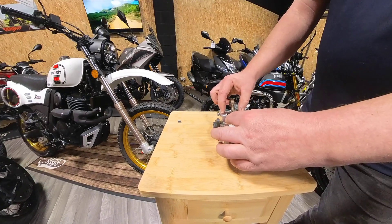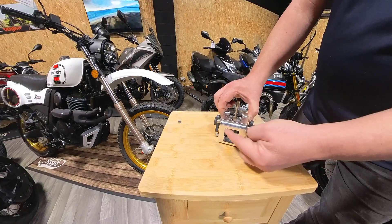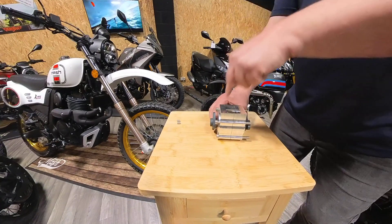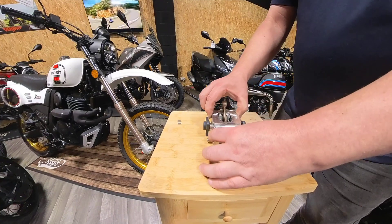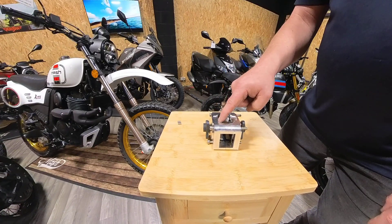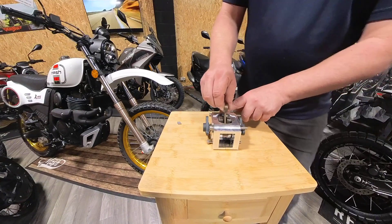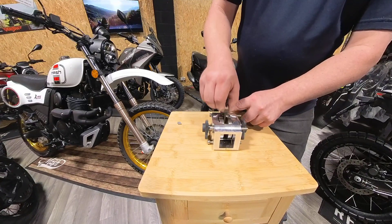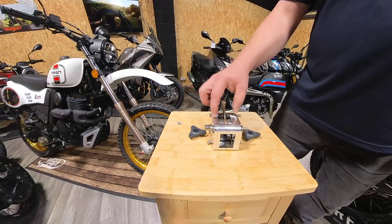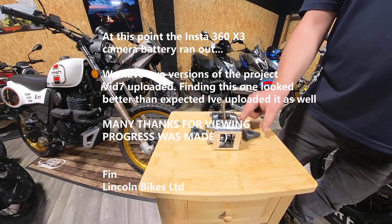This is where the cylinder's going to fit on top here. This is where the reed valve intakes are going to be. We've got to drill the holes on the top there, so I'm going to have to put them back in the machine that way around and drill down into there. I've got a ball-end cutter that can smooth and sculpture that out. But there we have our little crankcases. I've got the other two blanks to put in the machine — we'll get that machined this week. So we'll have two motors and then work out exact spacings and adapter plates to go between the two.